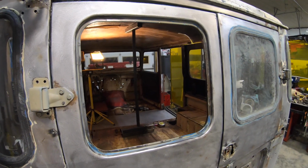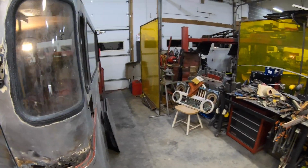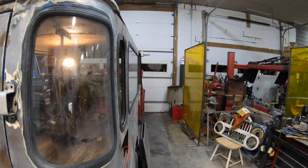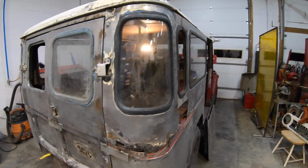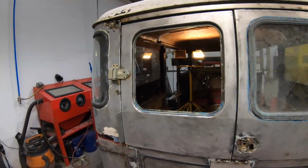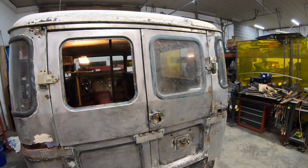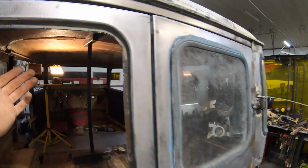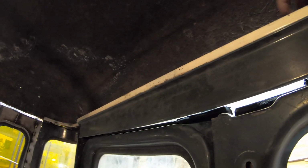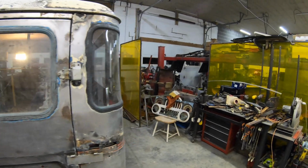And these steel rain gutters, they always rust out because the seal winds up that there's caulk, or a seam sealer that they put in around the rivets, and inevitably over time the sealant breaks down, probably with UV, and you start getting water and it washes under, and then there's kind of a lip on the inside here, right up underneath here, so you wind up getting water just sitting there, and so it rusts them out horribly.